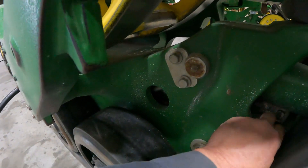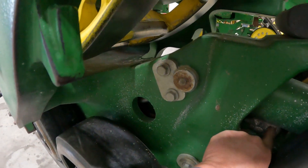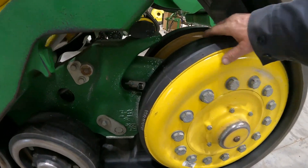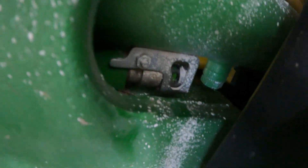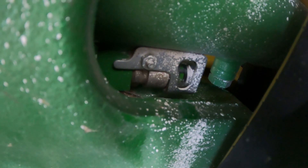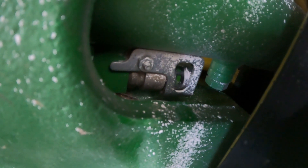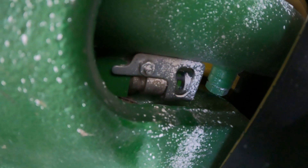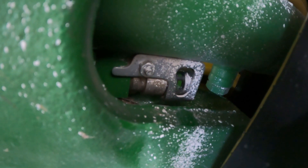If you're doing this, you can look right here on the front side of the idler roller carrier on the front side of the track - there is a gauge right there. That gauge is either red or green. If you're in the green, you have the proper amount of pressure or tension on your track.